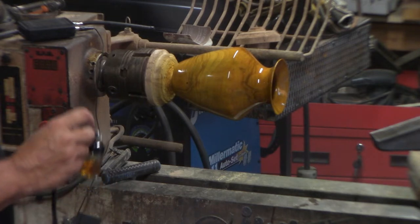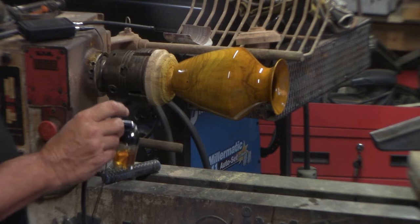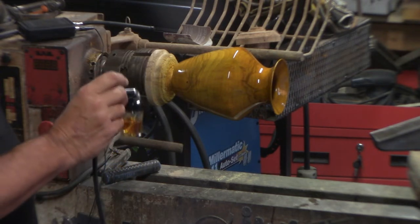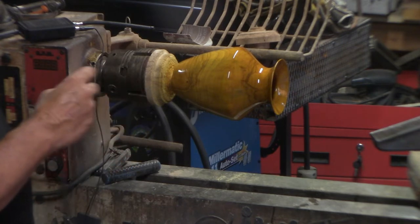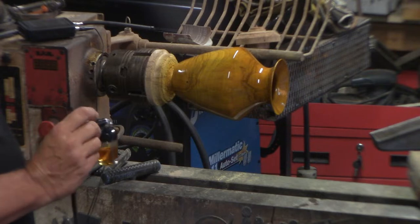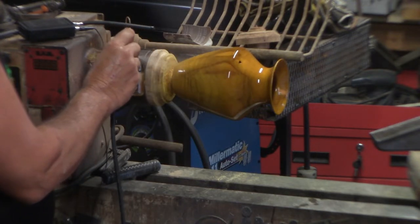Now, I like lacquer for a reason. Each coat of lacquer burns in, they call it burn-in. It burns into the previous coat of lacquer I put on. And I can keep building up coats of lacquer, and I can do it kind of quickly because lacquer dries very quickly. But this is about the Badger for the moment,